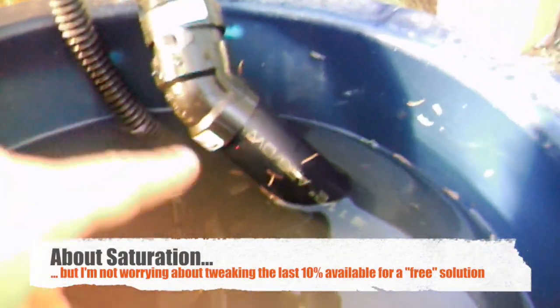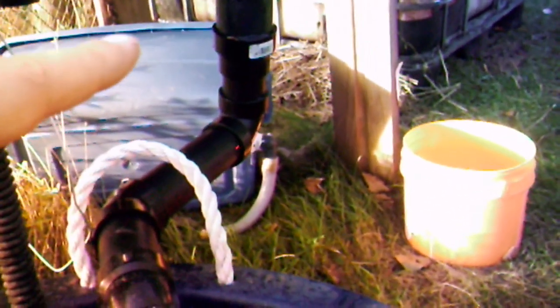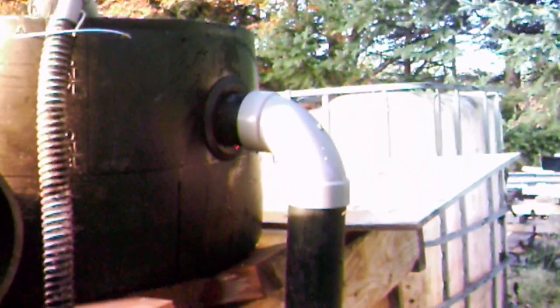So what really limits you is your bubble size. I've seen variations on a theme where you need to go to a reducer, to an expander, and then a long straight. But this approach seems to work for very little actual pipe. I'm thinking part of the reason it works is because I am already accelerating the water up here. I've got a long drop and a reducer, which increases the pressure. For every foot you drop water — or 30 centimeters — you generate half a psi of pressure. So between the end of the pipe here and the water line up there, there's probably 50 to 60 centimeters — probably a full psi running past the end of that pipe at the air inlet for the Venturi.